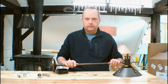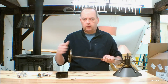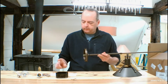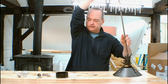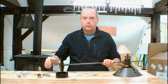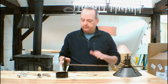You have different adjustable ranges. Because this rod can slide, it gives you a range — shorter or longer. This is divided up into what we call standard product: short, standard, and long. On this piece, the whole measurement is from the bottom of the fixture to the ceiling. The short range goes from 29 inches to 36.8 inches. The standard range is 35.2 to 43.2 inches. The long range is 45 to 52.7 inches.